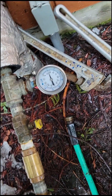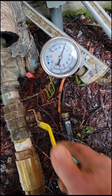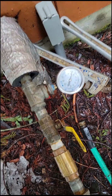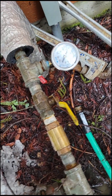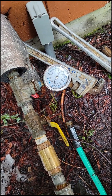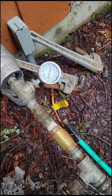There's a lot of water going out — a lot of water. Now I'm going to open up the air. You want to keep an eye on this so we don't get up over 80 to 100 pounds. At 100 pounds it's a little too much. Both houses are turned off though, so that's keeping the air out of the houses as much as we can. We'll let the air and the water go out. If we get too much pressure we're going to back off on the air and let the water come out. We're getting some air back into the pressure tank, I think.